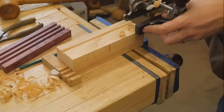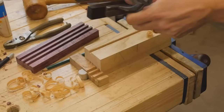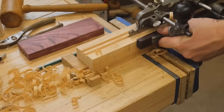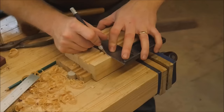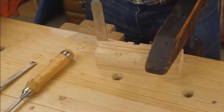Once I have all three of those grooves cut, then I can move on to the ash and make the matching grooves. These actually line up the purple heart to know exactly where they are on the ash, and then make my grooves. The depth stop is still set at the exact same point, so that I know that these grooves are precisely the same depth as the ones in the purple heart. This one only gets two grooves down the middle, as it only has to fit into the two humps created on the purple heart. Now I get to lay out all of the tongue and groove on the sides of the plane.